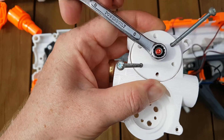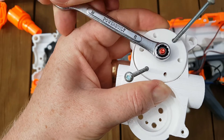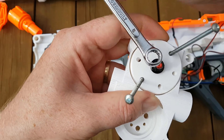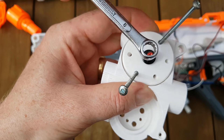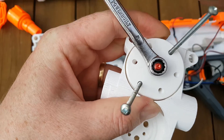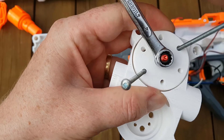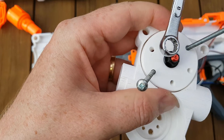On that topic, a lot of people say you don't need to care about what motors you get - it doesn't make a difference, you can just change the wiring. That's correct except for these bolts, which is where it is important. If you just buy two clockwise motors, then one side will actually start coming loose. Whereas if you buy the correct ones, the torque on the motor will actually continue to do up the bolt and it shouldn't come loose. That's why it's like that on propellers - which is of course what these are for - they will continue to tighten instead of coming loose.